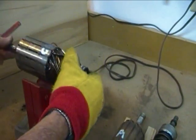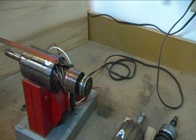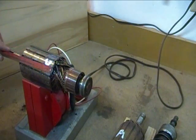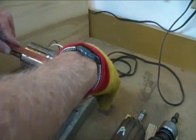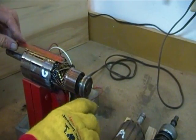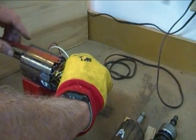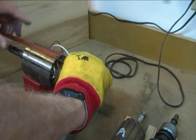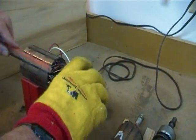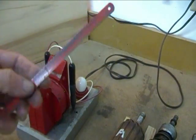Now we'll go to one of the two Cub Cadet starter generator armatures — this is letter C. Wow, something is really different, isn't it? There's a little less magnetism here than right there, but there certainly is magnetism. As I rotate it, right there there isn't very much at all, but there there's a lot. You can see that the hacksaw blade test really shows up very differently here — this is our bad one.